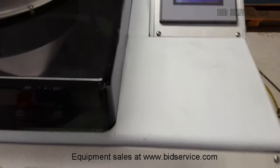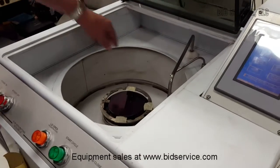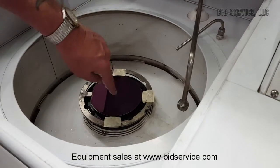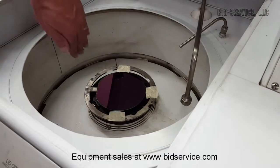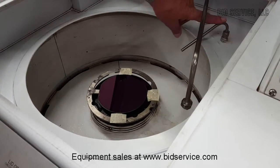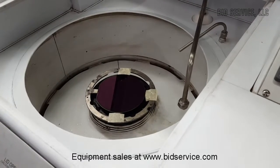I'm going to open up the lid. In here you have your wash arm, and this is the parked position. As it washes, this will be spinning — this is a wafer — and it will be moving the arm back and forth over the wafer to high-pressure wash it, washing up to 2,000 PSI. And this is the dry nitrogen arm here.